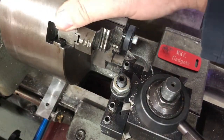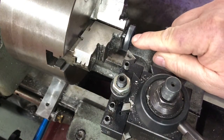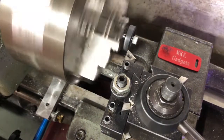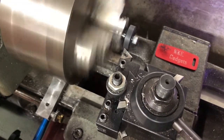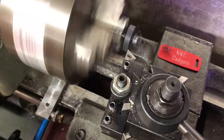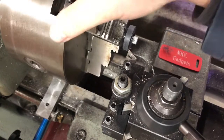This area has all been cleaned up, and there's just this area right here that's low. Once the silver is all gone, then I'll stop. With the silver all gone, we should be really true.